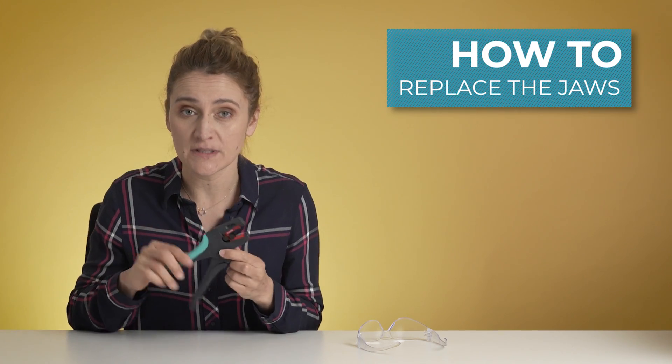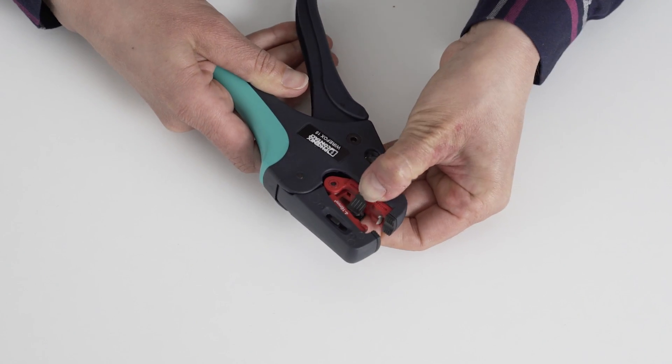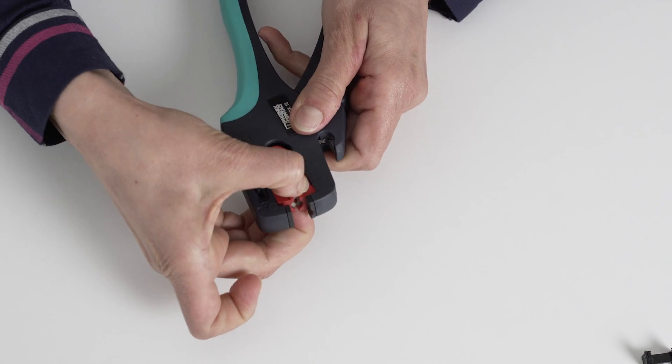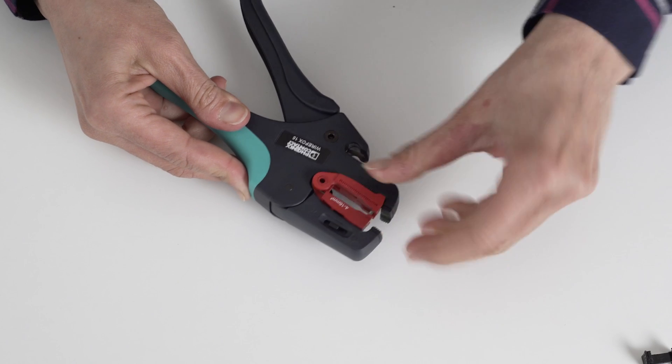As we have already mentioned, you can switch the blades and the clamping jaws. The easiest way to do so is to remove the limit stop, pull down the upper part of the blade and turn it to the side. Do the same with the bottom and push it out. Then you also have easy access to the retaining jaw. Just for the demonstration, I will replace it with the flat one.